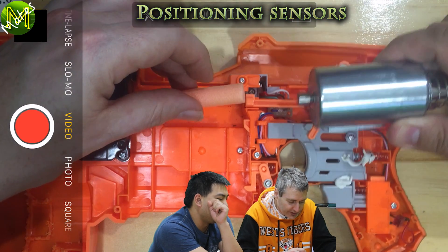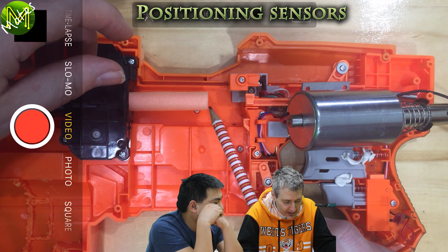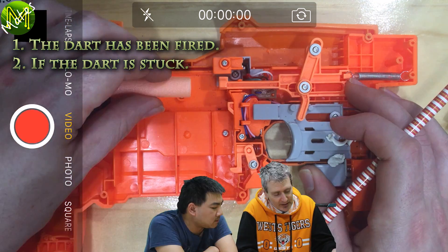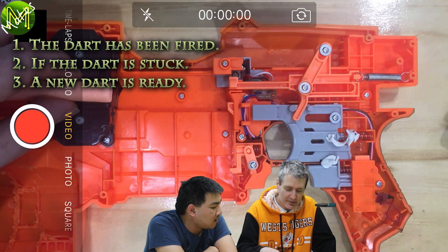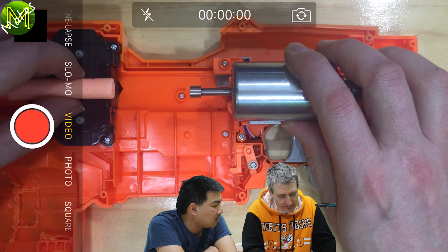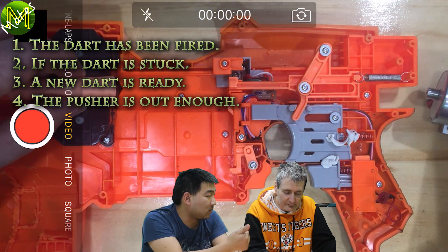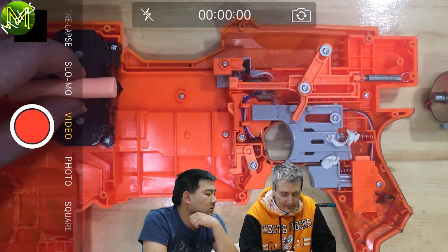Now that Tim has given me a rundown of how a Nerf gun works, it's time to look at what we need to monitor so that we can control the firing action with an Arduino, and maybe come up with some extra enhancements. This is engineering at its basic level - balancing pros and cons and finding the best solution. We need to know where the dart is at any given point, that the dart has actually left that position or whether it's stuck, and that the dart has come back up. If you're using a solenoid, you need to know if it's actually pushed out enough and whether it's fully back again.